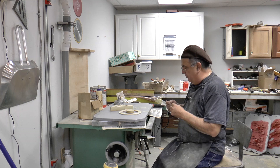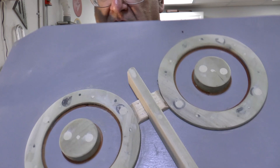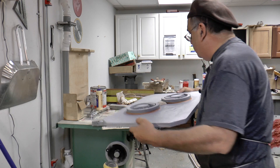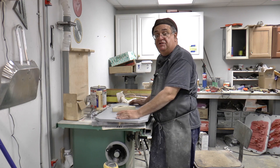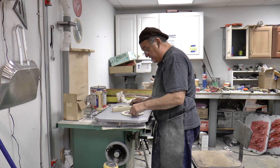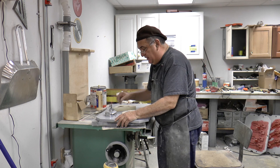Alright, we're back again. Got the leather all done - let me show you that. Here's the back now, you can see it there. Now I'm going to do wax. I've got leather all the way around - nice leather fillet at this side. Looks really good. And by the way, there's holes that have got to go on the end here for the pins, for the flask. I haven't been able to get them to give me the dimensions so I can put the holes in. They say they can fit it better, and they charge me $15 for it which is really cheap actually. So we don't put the holes in - let them do it. But anyway, got two different sized fillets on there, and now we're going to use wax.